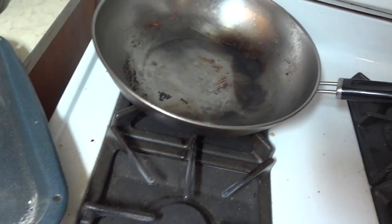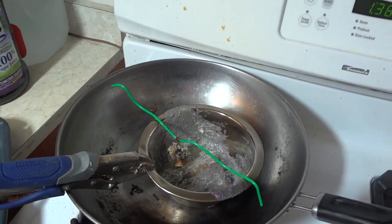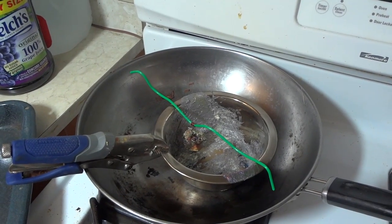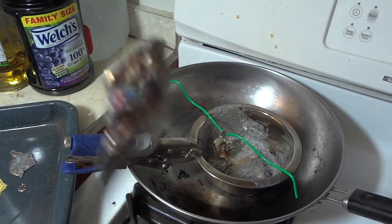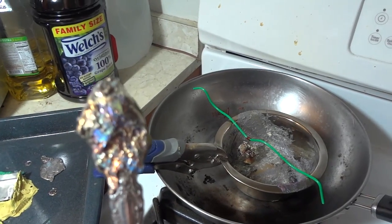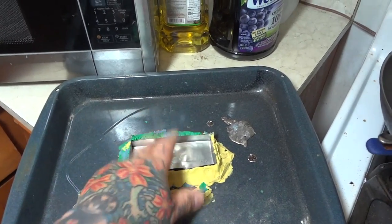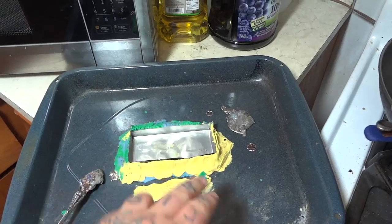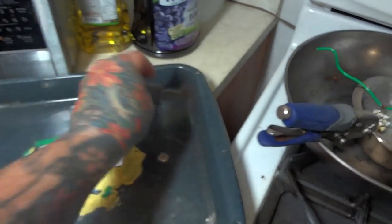I've actually removed this burner and placed it back, and I use a stainless dog dish bowl or cat bowl that I get at the pet store. I keep having to replace these because once they get encrusted with bismuth scalings they're basically impossible to get out. I use some old forks as a stirrer to actually take the bismuth scalings off. I need something to pour the excess off with, and what I use is an aluminum can cut into a box lined with clay. You can actually see where I dropped some bismuth onto the plate.